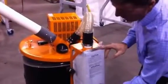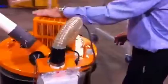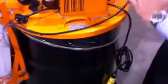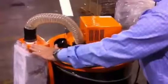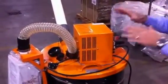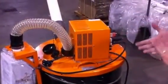For ease of operation, the system comes with a counter that tells you when the drum is full — there's a thousand lamps per drum. The system will actually shut down so the operator can replace the drum. Also, every four drum changes you'll need to replace the filter, and this counter will do the same thing — it will shut down, forcing you to replace the filter so there's no way to use the system when the filter is saturated.